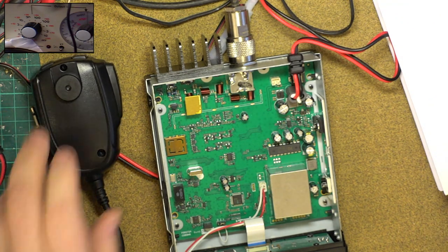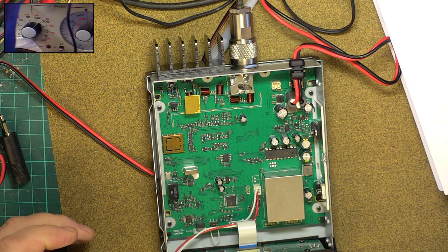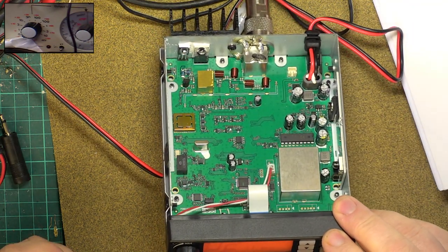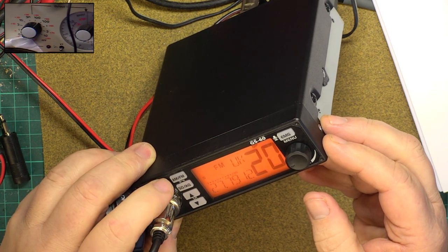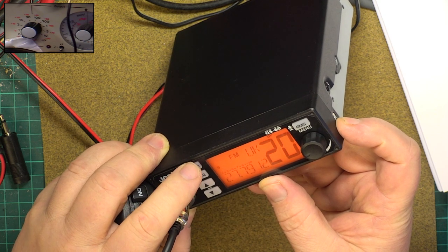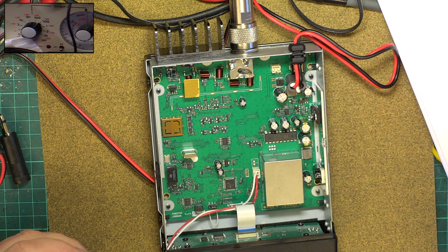and let's see what power the radio is doing. It's the usual. Oh, it's 2.5 watts. So let's look at the deviation. We'll do the whistle test. Why have I got nothing? Oh, we're on UK, but it's defaulted to CPT channels. So we have to press the AM/FM button. So if we press that again, what happens? It goes to AM on CPT, FM on CPT, and then FM, of course, on UK settings. So it does wrap around how you'd want it to for the UK. Wallow. Deviation's 1.8. So that's too low.